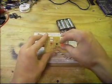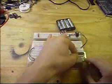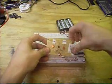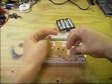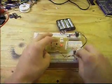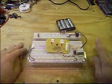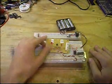Since this push button hasn't been hit, it's inverting the output from 0 to 1. So if I hit the button, it'll invert and go to low, and this red LED right here will show that it's low. It will also float, though it's kind of hard to tell at lower voltages. At around 7 volts it will be easier to tell with the float feature.